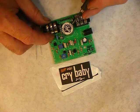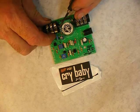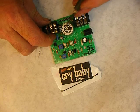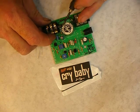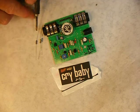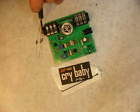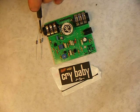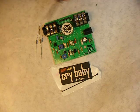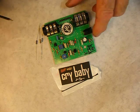I've got the Tone Tank inductor — my famous Tone Tank. I socketed the famous 33k, what people call the vocal resistor, that's parallel to the inductor right here. I've got the 59k in there — a nice mid step. In the kit I'm including a 33k, a 75k, and a 100k, so you've got four ranges going from the stock 33k all the way up to 100k.